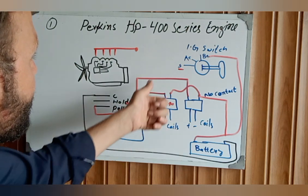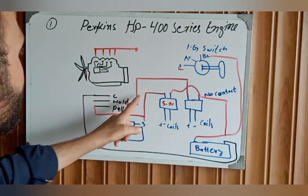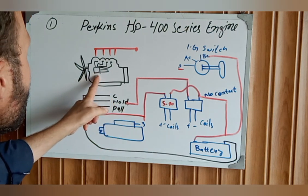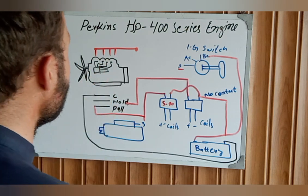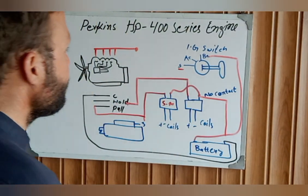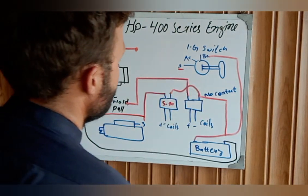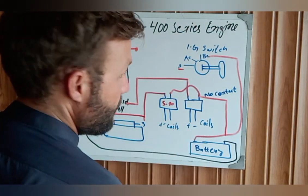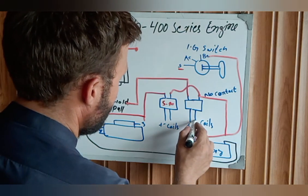This pull wire will be disconnected from the start terminal after cranking. After that, the relay sends a command to the hold wire, which holds the solenoid in the on position so the engine runs on the fuel system. This is the complete system — the start command goes to the relay, and this covers the full accessory circuit.